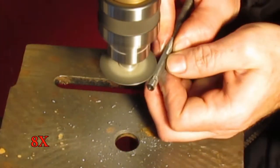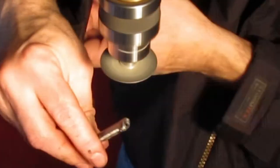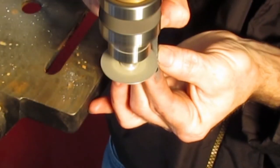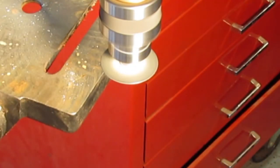I'm using water to aid as a lube and keeping the diamond from clogging. I have found that grinding soft materials tends to clog the wheel rather quickly. I use the wheel only for carbide grinding. I wear a mask as well. Grinding carbide creates very fine dust.